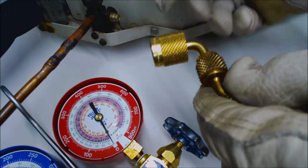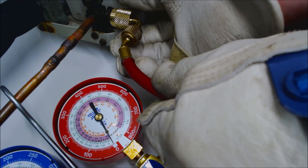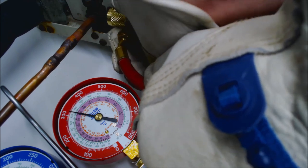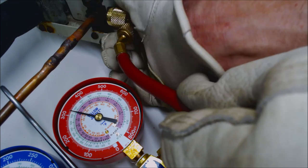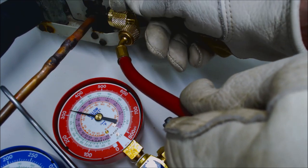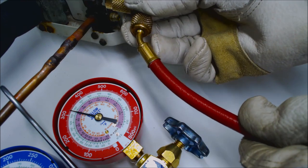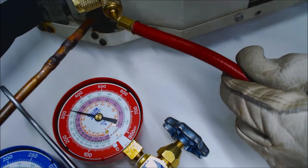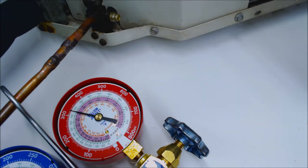Here we have the seal right coupler — you can get this in straight or 90 degrees, all linked in the description below. Screw this in fairly quickly, make sure you screw it in enough to get accurate pressure. When you unscrew it, it actually reseats the valve core before it releases from the port — the rubber seals against the port. After trapping the liquid refrigerant in the red hose, weigh it back into the vapor side so you're not wasting refrigerant or accidentally stealing refrigerant out of the system.